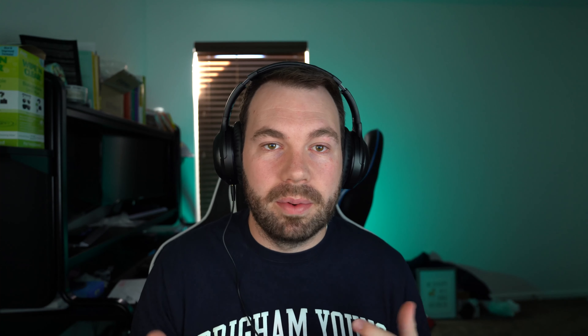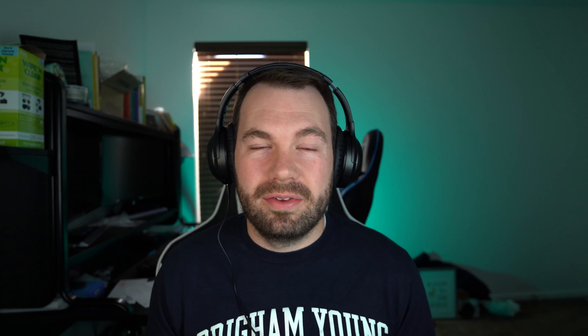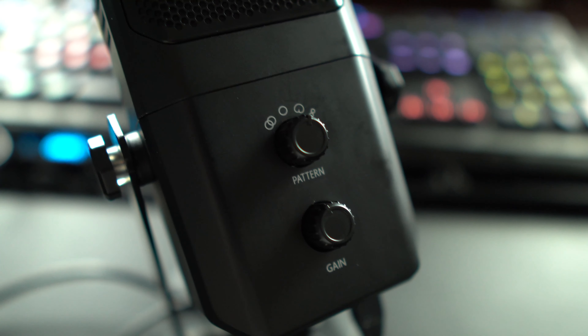The microphone has four different modes. There are knobs on the back of the mic that allow you to switch between them. I'm using cardioid mode right now, which is useful for podcasting, video chatting, and things like that where you're directly in front of the microphone and only your voice needs to be picked up. There is a stereo mode for recording music — I haven't tested it, but it's available. There is a bi-directional mode used for interviewing people: there are different pickups on each side of the mic, so if you're in an interview with you on one side and the person you're interviewing on the other, bi-directional would pick up both voices equally.